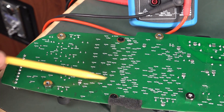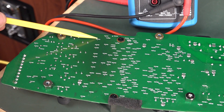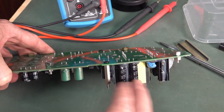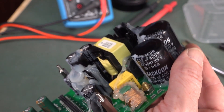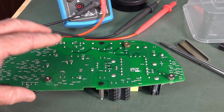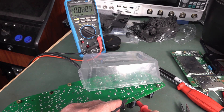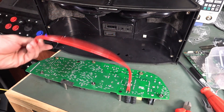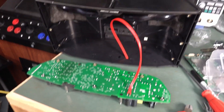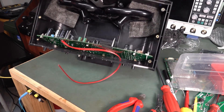You can see the burn mark there on the PCB where the five channels of audio output got hot. There are our output driver transistors on the bottom, discoloured. That choke is gone. So we should be able to just wire into these two caps here which are in parallel — Jackon brand, 35 volt jobbies — that's the 25 volt output. And I did check the datasheet for the TI chip: it will accept up to 26 volts. So 25 volts, no problem. Let's double check — 25 volts. No wuckers. We've already got an existing hole, we can feed the wire down there and route it to the board on the bottom side.